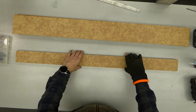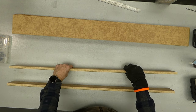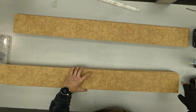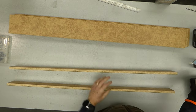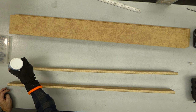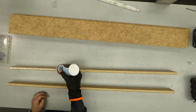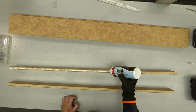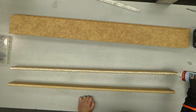Okay, let's screw the sides and the top together. I'm going to stand up my two sides and then put my top on. I'll glue it and screw it every 200mm. I always use PVA glue. I just like the joints to have a bit of glue in them, even on accessories and jigs and bits and pieces. I tend to always glue them — makes them that little bit stronger.